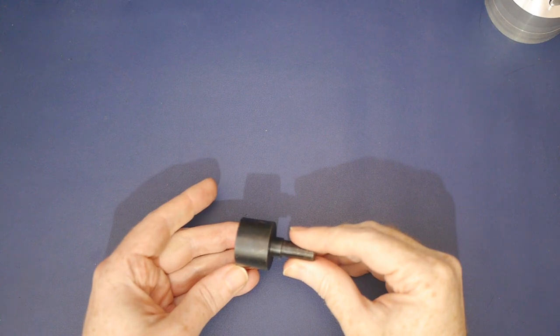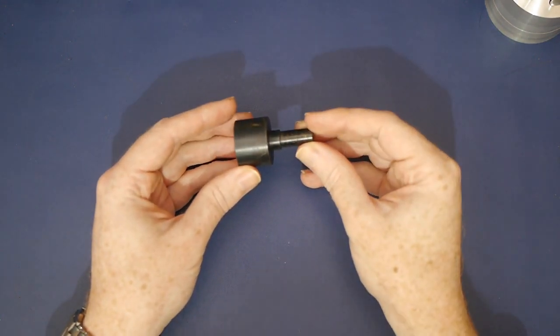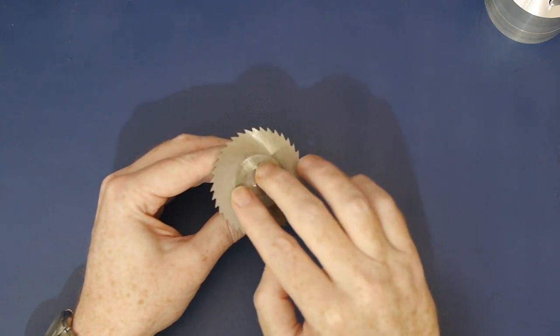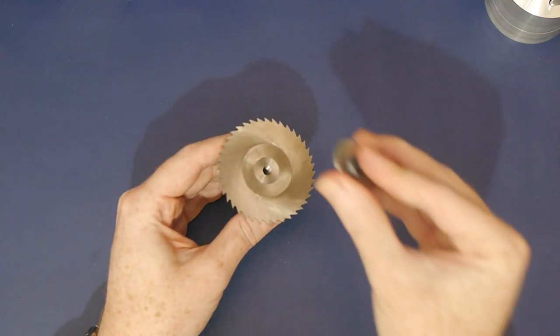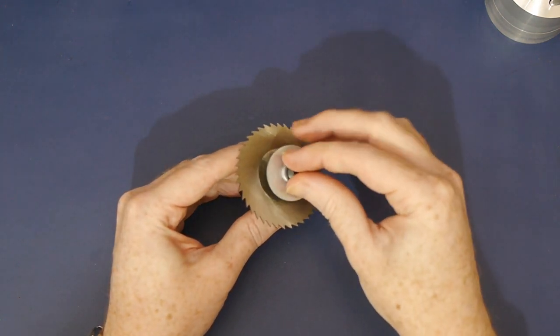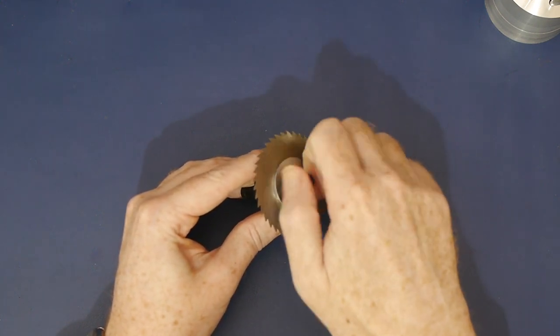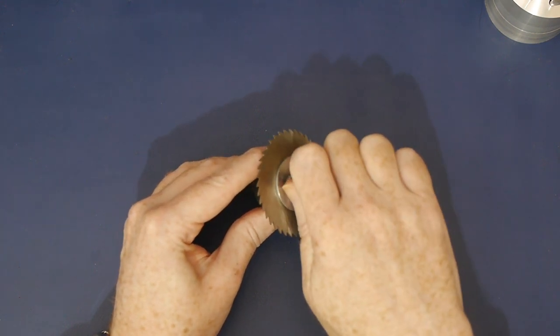This is the first tool I ever made on the lathe. Leaving aside the blotchy bluing, it's not a good tool. It's intended to be a slitting saw arbor, but has no real way to accommodate different slot widths without machining custom spacing washers. This is the project that taught me about runout, especially when using a three-jaw scroll chuck. The saw runs way out of true, and I consider this tool basically useless. I keep it in my box of written-off parts as a memento.